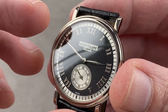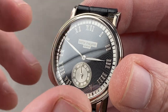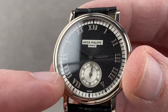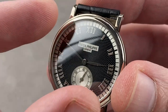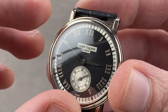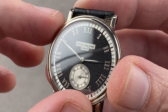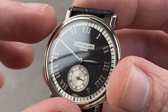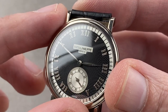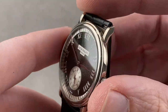I mentioned this as a craft art piece — this is real rose-lathe guilloché. This dial was not stamped. The numerals themselves are made of white gold, as are the hands, but inboard of the outer track, which you can see is a silver satin metallic, you can see an exceptional rose-lathe pattern that would have been planned by a guillocheur. He would have then programmed his lathe using a cam system and hand-guided the guilloché device to engrave this dial. It is truly special. There's a railroad track inboard for the sub-seconds, and that features a concentric pattern on silver. All of the numerals themselves are appliqué, and you can see Patek used a watchmaker's four.